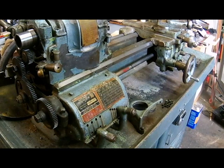Once I get the cabinet and the bed done, it'll be a piece of cake to reassemble everything else. Of course I'll be looking at the wear of the carriage, seeing what's up with that — whether it needs to be ground and turcited. I'm going to do it one step at a time, but at least if I get the cabinet and bed done I can take my time on the smaller pieces.